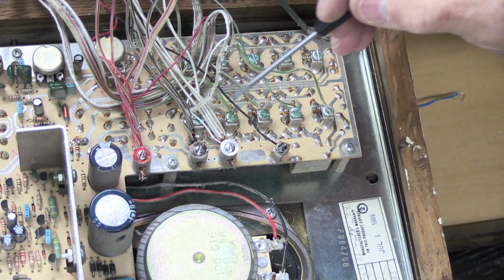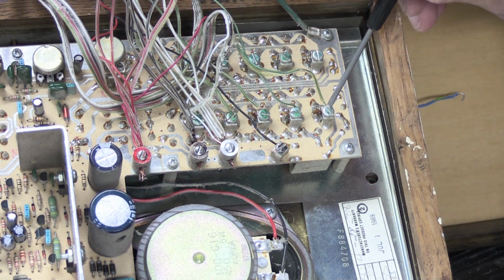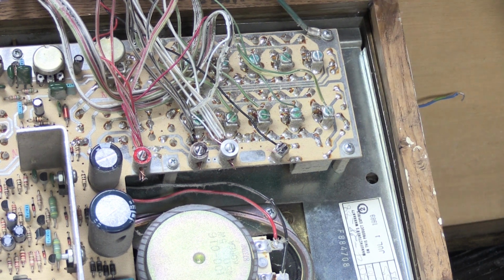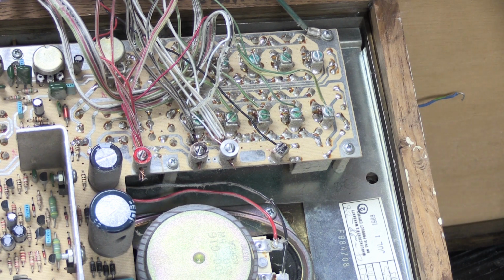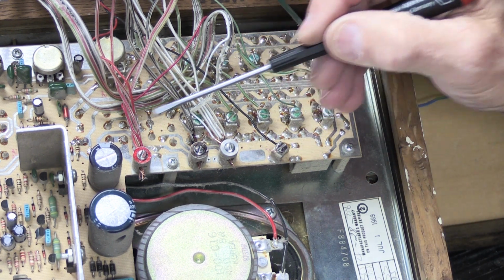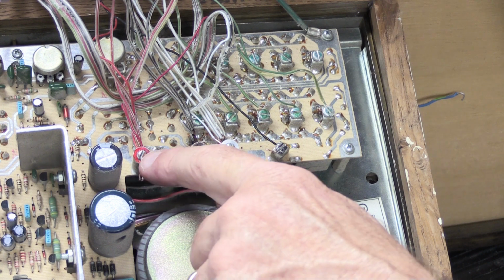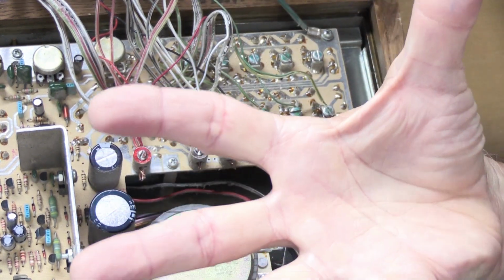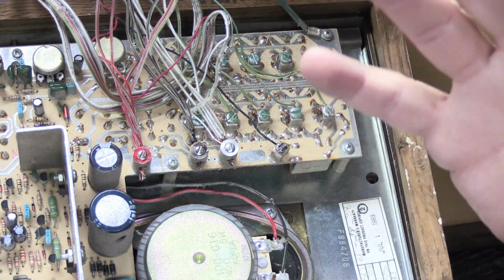And then down here, buried underneath some of the wires to some degree, are the 10 green screws. There's 1, 2, 3, 4, 5, and then 5 more on the bottom row for a total of 10. Since this installation has 5 remote speakers, not counting the door station, there are 5 green wires. This is the part, remember I told you in the beginning, this is not that complicated, but it tends to be kind of messy. Well, that's because when you have terminations like this, where you have a bunch of red wires here, a bunch of black wires here, a bunch of white wires, and they're all pushed into these binding posts, when you loosen the screw on the binding post and take these out, they're all going to want to go like this and come apart. And that makes it difficult for people because you've got all of these loose wires and people freak out and don't know what to do.